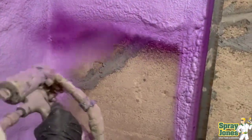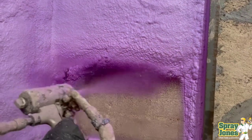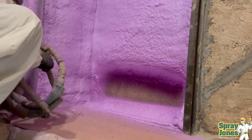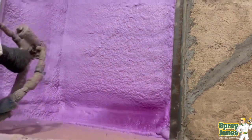This is the only solution that should be used for these basements, folks, because it's going to adhere very tenaciously to all of the cracks and crevices and all the little inclusions of the concrete. This basement would have been poured probably in about the 1940s with the old boards — it's not a modern foundation. But what we're going to do is stop the water from coming through. Any moisture that's migrating through the concrete, through the porosity and through the cracks, is going to be stopped at the spray foam.